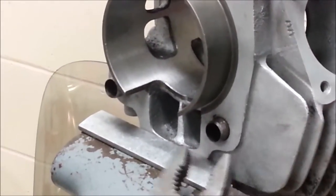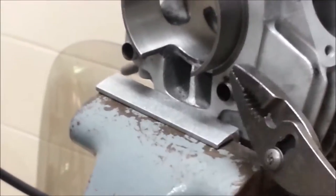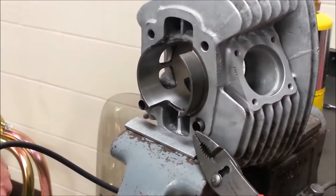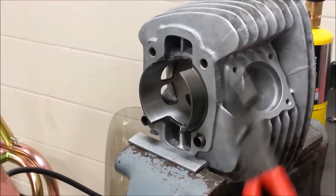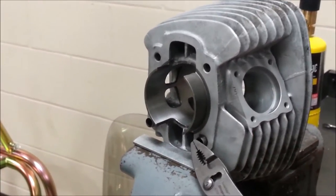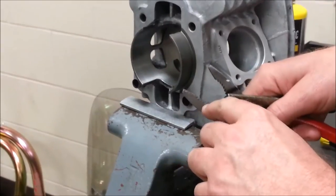The problem with these dowel pins is that if I want to remove this, I'm usually going to grab pliers and just crush it and ruin it. If I put any scratches on a dowel pin, I ruin it — because it's a machined surface. It's not a rough bolt. That dowel pin has to be going into a precision hole to precisely align something else.